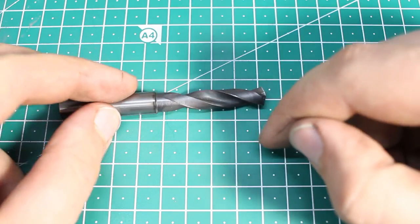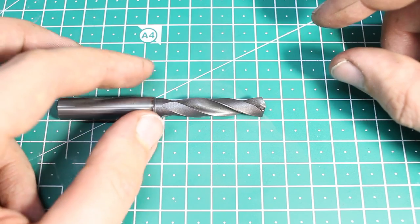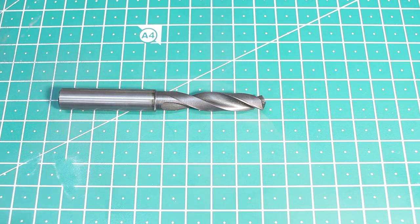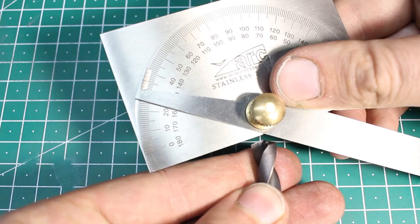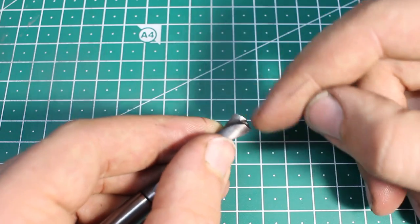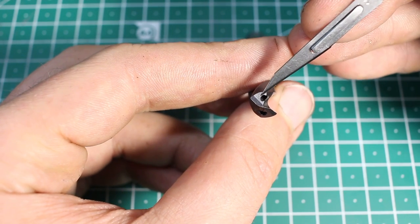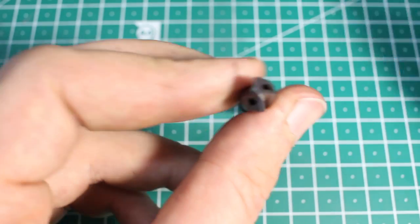First thing we want to know is the included angle on the drill tip. On a normal high-speed steel twist drill, that's 118 degrees. With the carbide drills, parabolic flute, HPC drills and stuff like that, all bets are off. You need to measure the angle. So a very simple angle protractor is good enough. And this is a 135 degree drill. So that's what we're going to grind. The primary relief here usually has a clearance angle of about 4 to 5 degrees. The secondary relief usually is about 15 to 20 degrees. So let's go to the D-bit grinder and set this up.